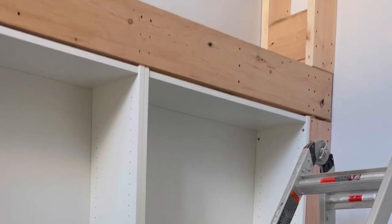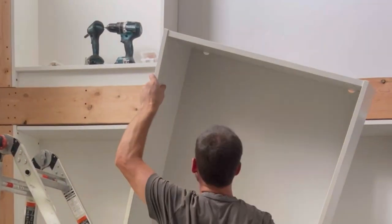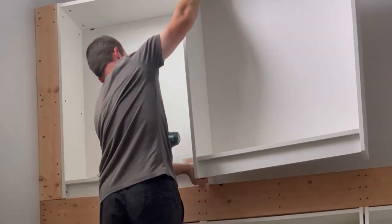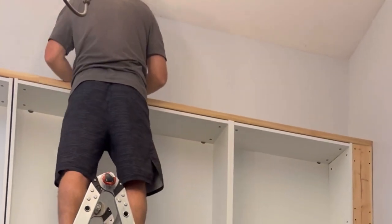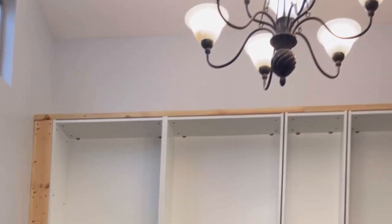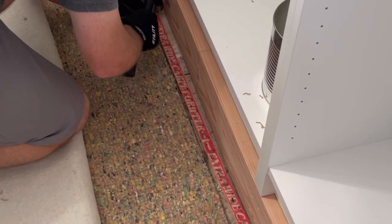Now build the upper side supports, just like the lower ones but at the height of 41 and 3/4 inches to match the upper bookcases. Bring the bookcases up — which is exciting but a little scary on the tall ladders. At the very top we added extra supports made with 2x4s for additional security, and also added more anti-tip kits.